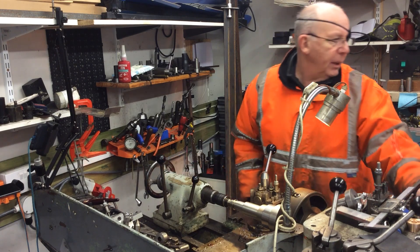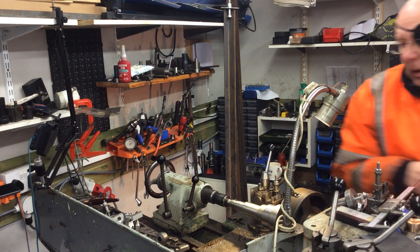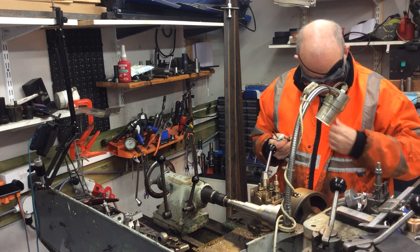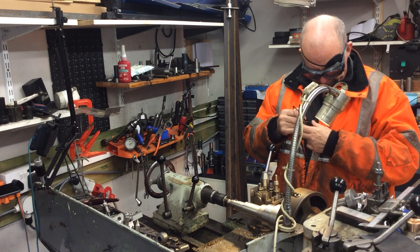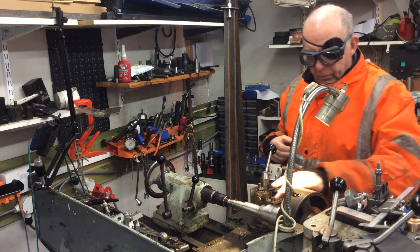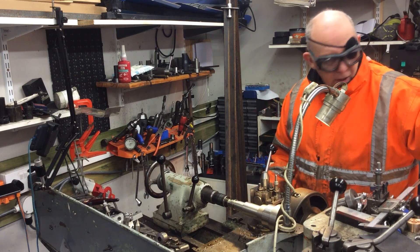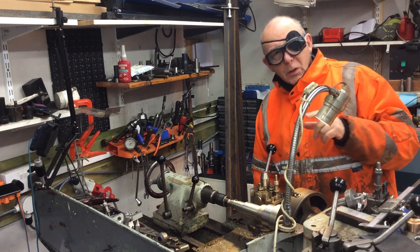So I'm now going to do a little bit of work on here. I'll do a quick swap to my safety glasses. The only thing holding this on is friction of the interior bore and the 30 International adapter, so I'm going to be taking fairly light cuts on this to take it down — once I've gone and turned the power on.